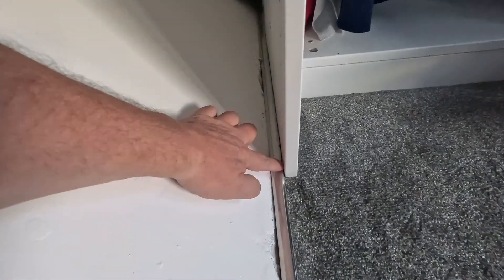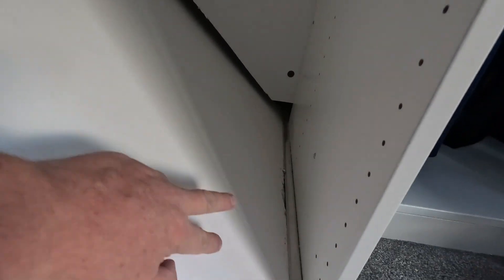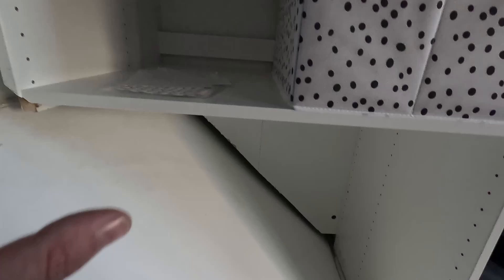I made up a little cardboard template for that corner there because it's not a complete right angle. I'll put a link to angle finder on Amazon - I use it all the time, it's very handy. You've got a little flat there, and I've used the multi-tool to cut that out and it works out perfectly. The plan is to put a plinth in here like that on a normal wardrobe, and then I've got spare shelves cut down to cover that gap. At the back I'll put some blocks so the shelves sit there.